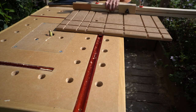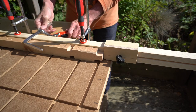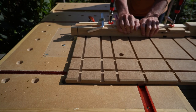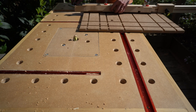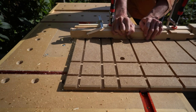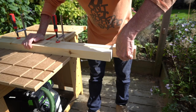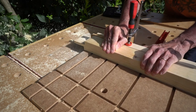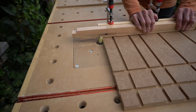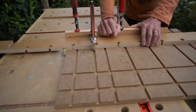Okay, so it's time to have a play with my new jig. First of all I squared the fence up with the edge of the jig and clamped it down with two try squares. I can then use a further square to hold the stock to the fence, or indeed the stock to the jig. This piece here is just a piece of scrap I'm experimenting with, and here I'm tightening up the stop to make repeatable cuts.